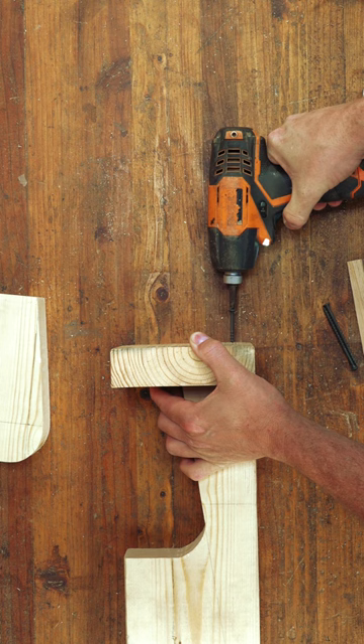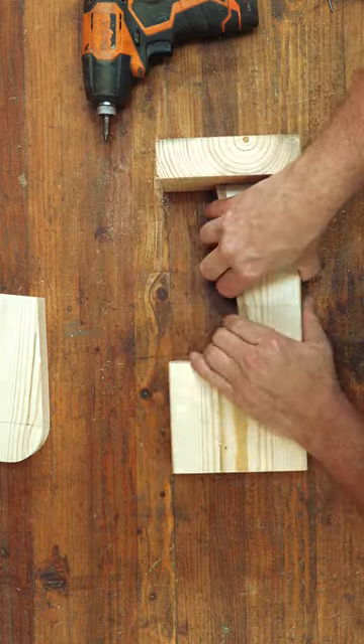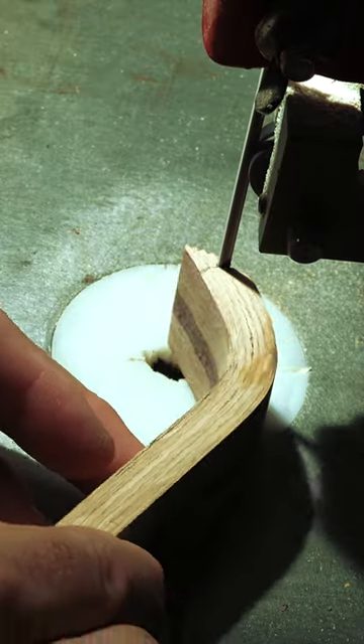We'll make a form by cutting the shape out and add a piece of scrap to the edge with three screws. Each piece of strip will need to be trained or flexed, but then we can squeeze the pieces together. The end will sandwich or form together, and I found adding a thin dowel gets a tighter area in the crook. To finish, I rounded the edges and cut it to size.